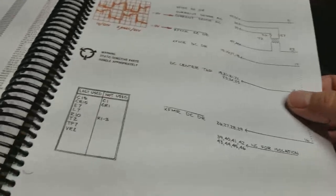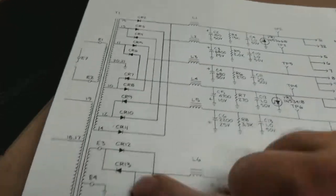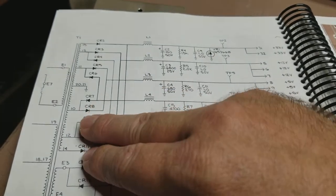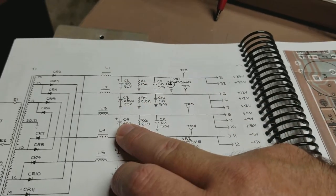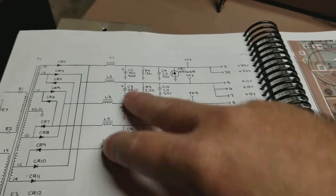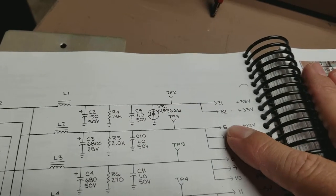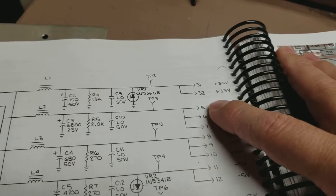Looking at the A5 output board schematic: we have our chopping transformer, and we get DC voltages out after rectification. We filter those to remove spikes and clean the signal with some pretty large capacitors — 6800 microfarad, 680 microfarad — trying to eliminate all the nasty signals and get us a nice clean output. There is also a Zener diode built in. Test point 0.3 corresponds to pins 5, 6, and 7 on the card — they're all connected together.